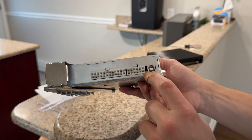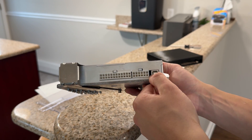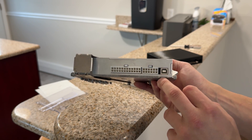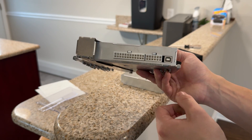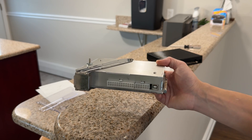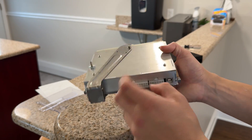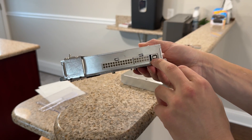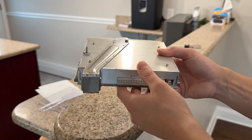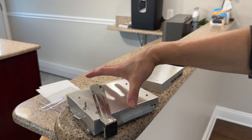The metal case actually touches the USB shield. On this design, the USB shield is only grounded on the host side, not the device side, and that is per FTDI's recommendations and approved designs. Basically, if you connect your shield to the PCB's ground plane, your USB cable is going to act as a giant antenna and can potentially inject all the electromagnetic interference from the engine bay — things like injectors, coils, VR sensors — into the ground plane and cause issues. So the full metal case is floating, as well as the USB shield on the device side. But since it's all touching, it's connected to the USB shield on the host side, so it should help absorb any EMI potentially interfering with the circuitry when the USB cable is connected. I did a bunch of test driving and everything seems to be working really well.